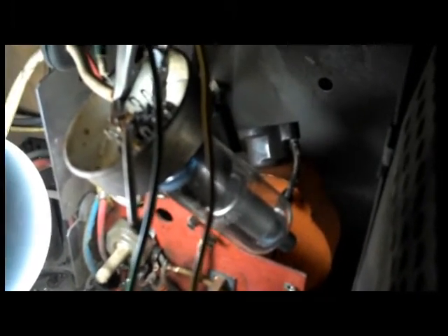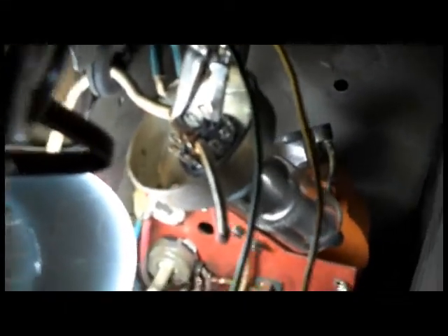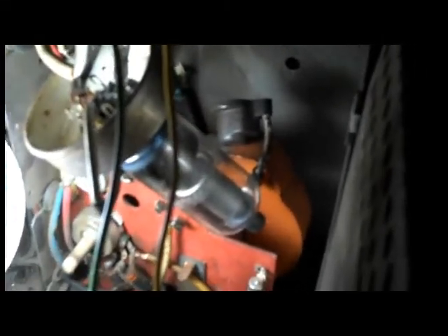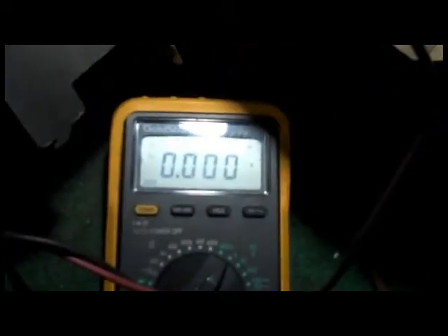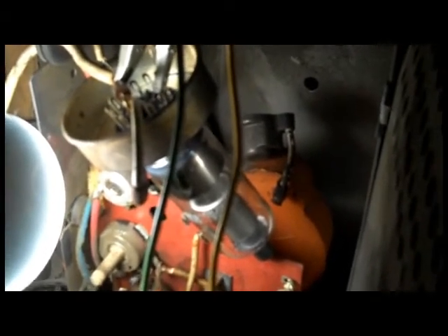Just for a verification test I'm going to test this with the actual load of the tube filament. I put the high voltage rectifier tube back in — the cap is not hooked up — and I want to keep this high voltage lead as far away from me and everything as possible. I don't really care if it pops off and arcs to ground, but I don't want to get shocked or my meter destroyed. I have my meter on AC and my light, and I want to measure the actual voltage I'm getting. My main thing is to play it safe and stay away from that.